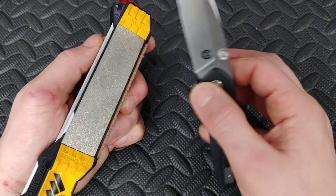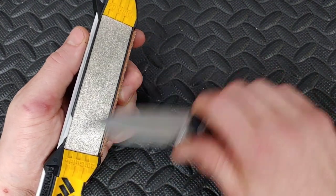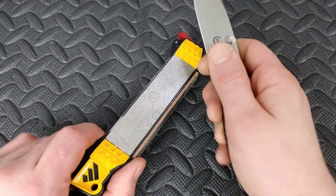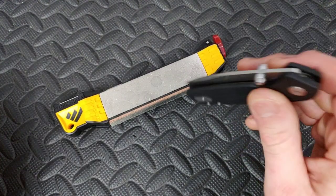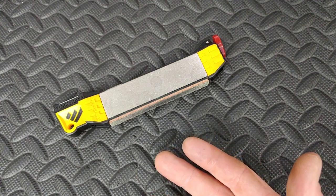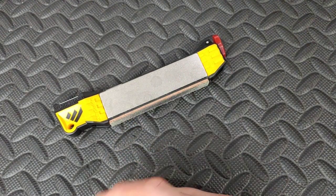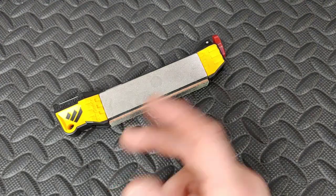When you're knocking off your burr, use no pressure at all — just let the edge slide across the diamonds. When you're actually sharpening and putting a little bit of pressure, don't put much, because if you come off the stone you can come off fast — you don't have a big area to work with. You've got to get good with sharpening in tighter areas. As for the built-in angle guide: you can absolutely use it, but I find it a little shallow for me. A lot of factory angles are at 20 degrees, but when reprofiling I prefer less than 20 degrees.